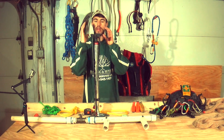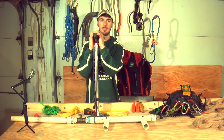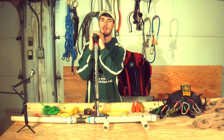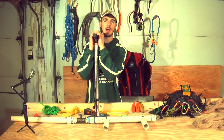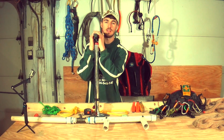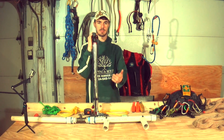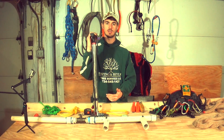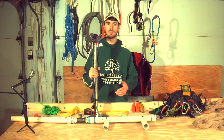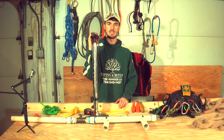Do not get a Walmart bike pump, or just any generic bike pump, because you will go through them. They don't hold up. Go to a local bike shop and pick up a good bike pump. This will cost you more than the gun itself, but it's worth it because you need something reliable, and these are a lot easier to pressurize a gun. You need a good pump, otherwise you're pumping forever and it's really hard. This thing makes it a lot easier.